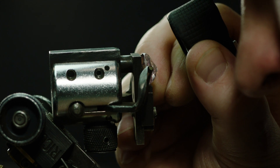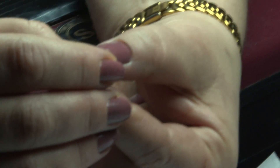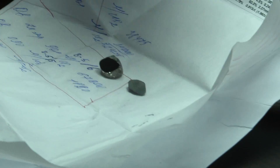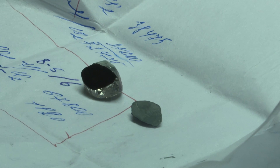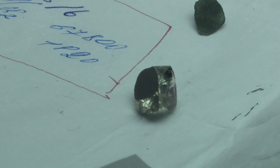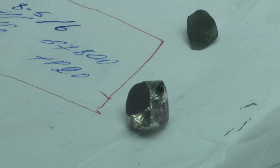When you're polishing by hand, you can see exactly how things are going. Marina is holding a crystal which has been cut — here are the two parts together, cut into two pieces. The advantage is that you can still get something out of the little piece — make a small diamond — while the larger one is processed further. What's really surprising is that the cut surface is black, because the laser converts the diamond just near where it is cutting from the traditional diamond structure into graphite.